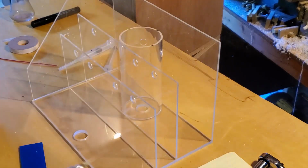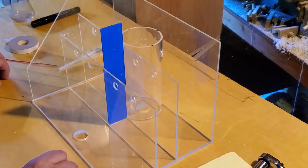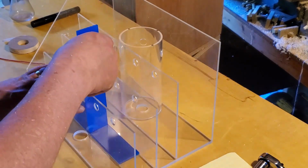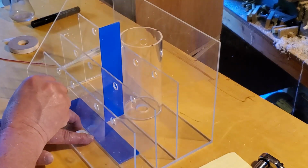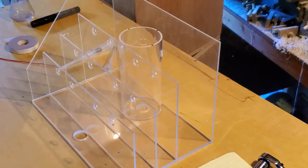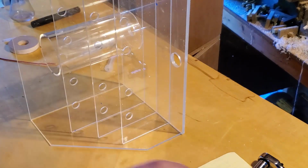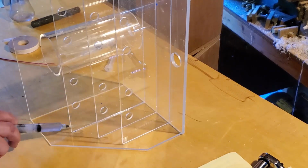And then because there's 2 of them like this, I can put one near the bottom and get that relatively in position, and then I can put the vertical in here like this to make sure it's 90 degrees. So that was actually quite good. Now, unfortunately, when I went to this one here, I wasn't able to do that because the only thing holding this in place at all is that little bit of a weld in the bottom that hasn't quite set yet. So again, it was good enough at this point to get the bottom parallel, and then when I flip it over here on the end like this, I went and made sure that I could get them all actually vertical, so square to the bottom. It wasn't very difficult at all.